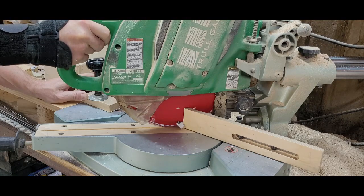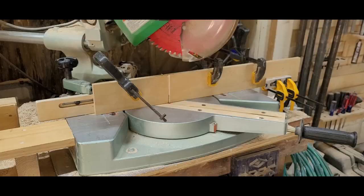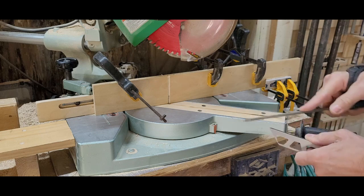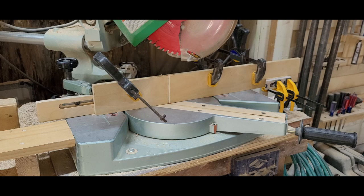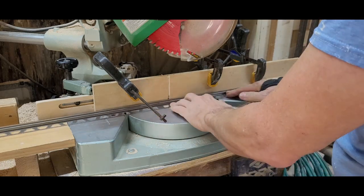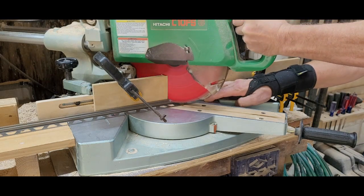I also stayed well clear of the right side of the blade in case any small bits of aluminum went flying. After determining the length I'd need, and doing some head scratching, I changed the miter saw setup. I added a secondary fence that was long enough to attach a stop block to. That stop block was cut at 45 degrees to match the angle of the pieces I'd already cut. Before each cut, I made sure to knock off any burrs from the previous miter, ensuring the strips would seat fully against the stop. Then I could make the second miter cut on the opposite end. Since the tiles will create a square, all 4 Schluter strips were cut to the same size.